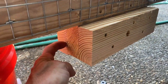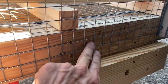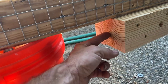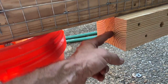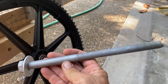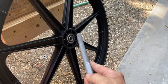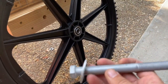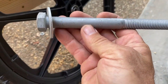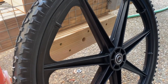We got two 2x8s and this is a 2x8 that goes up to the top. I screw through the frame of the Chickshaw into that 2x8. So this 2x8 is actually holding the two 2x4s. I screwed the first one on, then the second one, then I drilled a 5/8-inch hole through here. All the axles I found were either 5/8 of an inch or 3/4 — I bought a 5/8-inch bolt, the 10-inch which was longer, because I wanted a smooth shank. I didn't want the threaded section to end up inside the bearings of the axle. So I just used the bolt as the axle. I'm putting a washer on the outside, washer between the wood and the wheel, and a washer on the inside behind the nut.